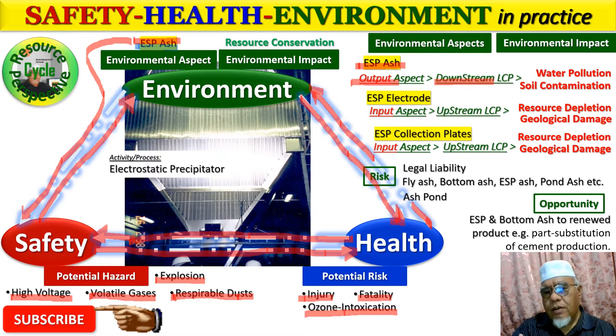Now, the ESP ash usually will be sent to what is called the ash pond, and that would definitely cause some form of contamination of the bottom of the pond. If it is not lined, then it will be causing some form of soil contamination. And as you know, some of this ESP ash, when we sent for analysis, has a substantial amount of even mercury, because the boiler furnace is not operating in the region of 900 to 1000 C. We could still see a lot of heavy metals when we took samples. And from the ash pond, where settling occurs, the cleared water would be discharged into waterways, into inland water, and that would cause some form of water pollution